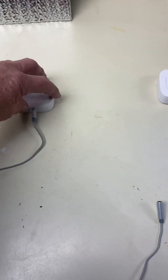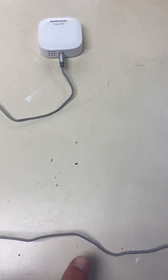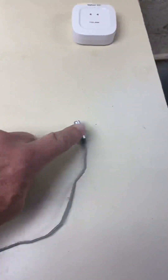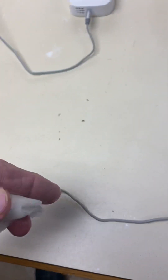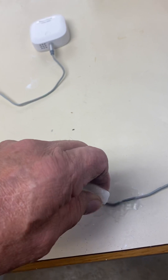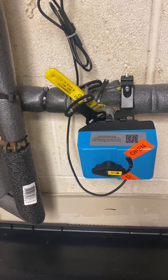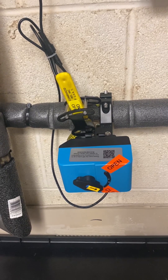This is the sensor. I'm going to put it in the washer and dryer area. If it sees water anywhere on this cable, it will close the valve. You can also add an extension to it. I'll put a drop of water on there — it'll flash red — and over here you can see it's closing the ball valve. It takes about 20 seconds to close.